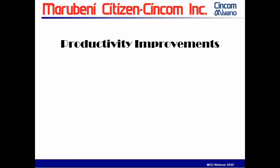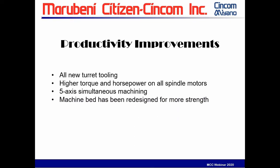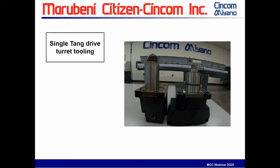Some significant productivity improvements have been made on this latest generation of the M. One of the things is we've changed to a new style of turret tooling. We've increased the torque and horsepower on all spindle motors. 5-axis simultaneous machining is now possible. The machine bed has been redesigned for more strength. There is now a guide bushingless function. The operating panel has been redesigned. The human interface is redesigned for more clarity and ease of use. It has a larger access door to make it easier to work in the machine.